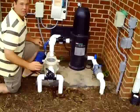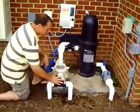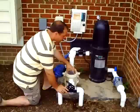You have water that's coming from the pool over to this point. The water is coming in through these two pipes. One of these is coming from a skimmer, the other one is coming through the main drains in the back wall at the bottom of the floor of the pool. And this water is pulled into the pump. This is called the suction side — everything on this end is being sucked into the pool pump.